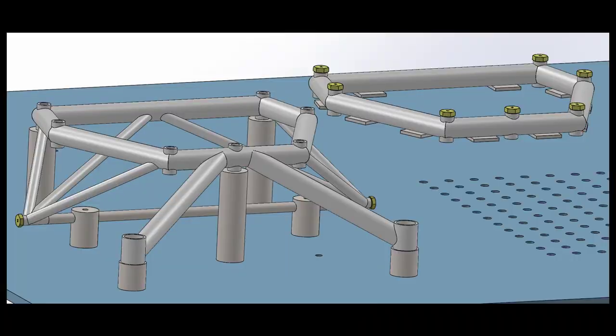At the same time, we created a specialized table in the shop that is designed to accept weld jigs. It's a 3/8 inch top. I can tap into it, I can drill through it, I can put bolts through it, and it allows us to fixture those components very rigidly and allow them to be welded and to be cooled while still in the fixture, and then to be able to take the fixture apart and the whole weldment comes out as one piece.